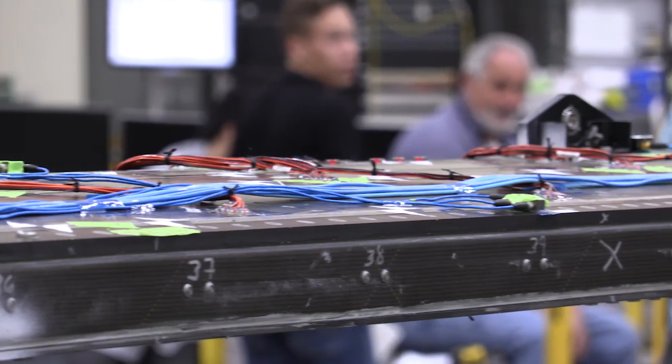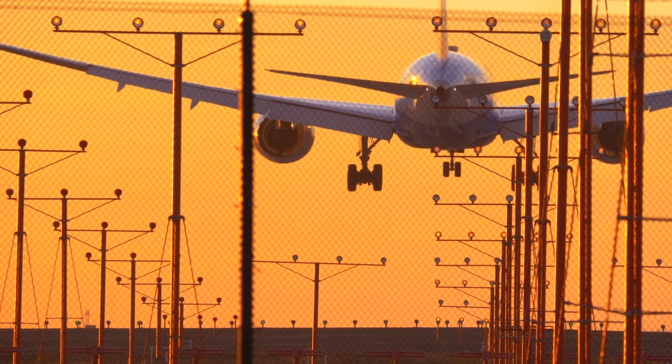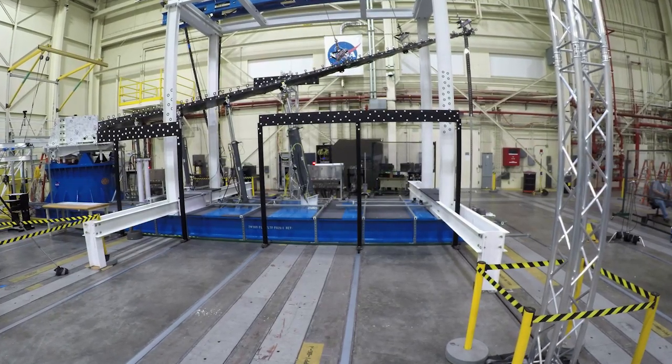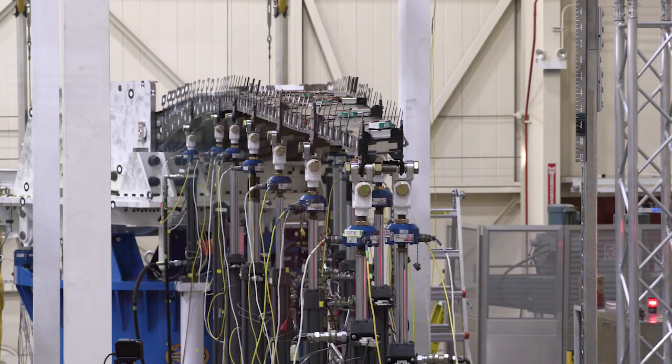In future transports, we see the wings are getting larger, longer, and thinner for aerodynamic benefits, mostly for drag reduction. And so the challenge is when wings get longer and thinner, they become more flexible. The intention of this particular test was to try to control that flexibility to allow us to still build a lightweight wing with the structural benefits and enable the aerodynamic benefits simultaneously.